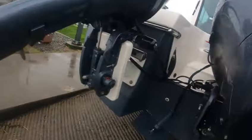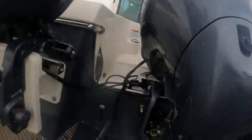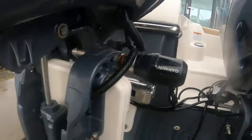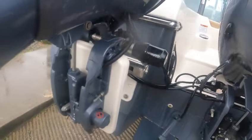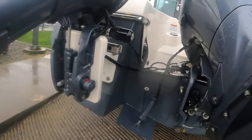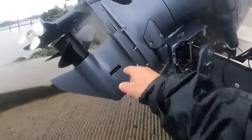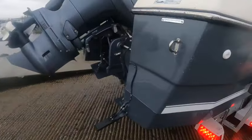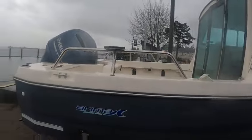It's got the fresh water flush on both of these motors — that one there and one on the other side. That one looks broken, but they could fix it. That's your water flow. When you use those, do not start the motor — just remember that. If you start the motor, you want to always have water going to the motor.